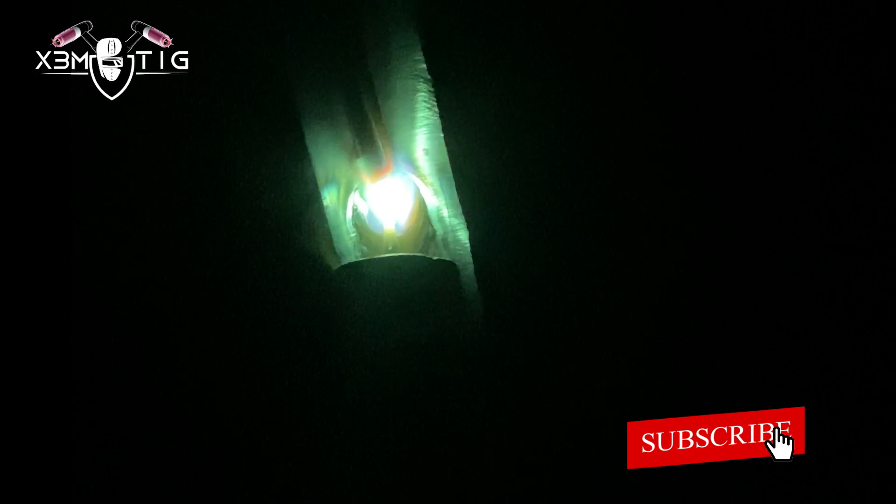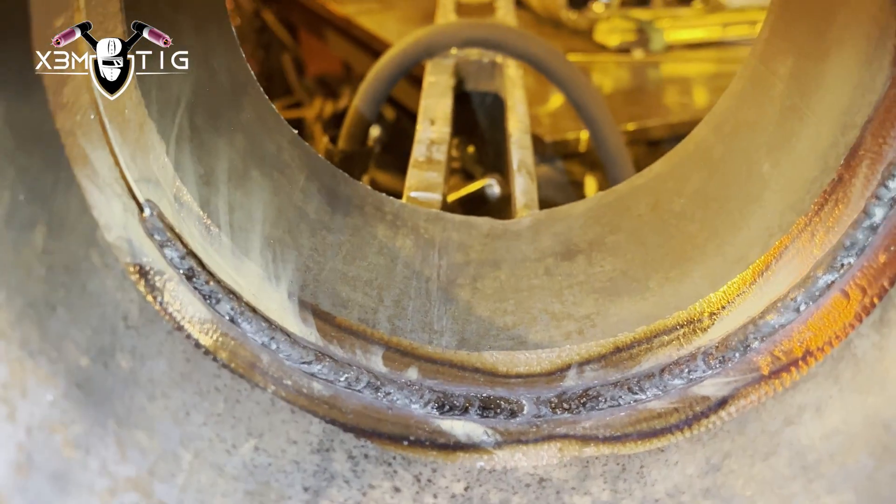The dip technique is one of the best for me — it's all about habit and personal preference. With dipping you control everything: you've got both sides burned, you can see the edges opening up. You control the feed speed, the amount of material you're depositing. You're on the safe side, especially for x-ray. If it's a bigger gap, slow down and go down on the amps.